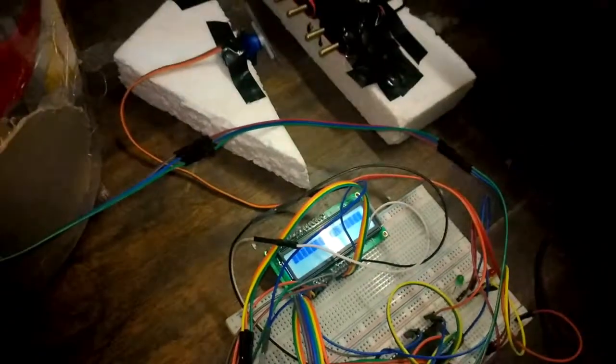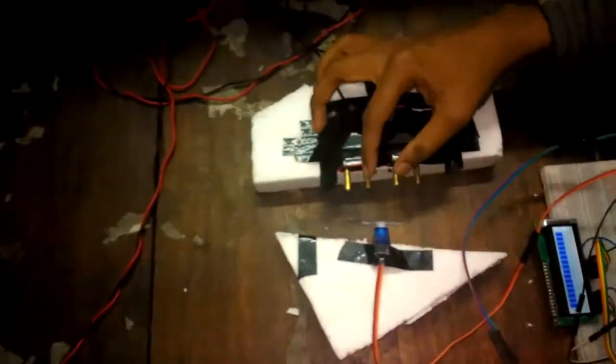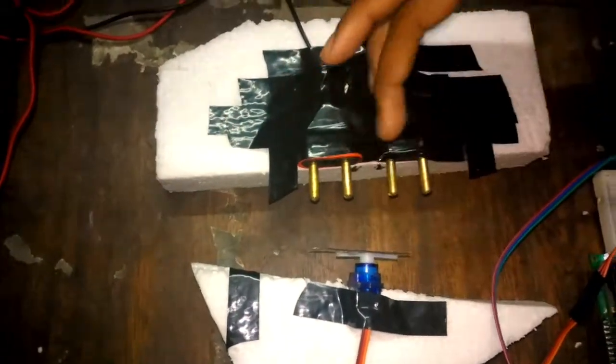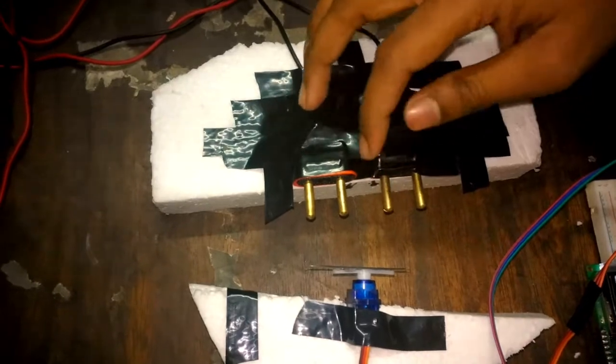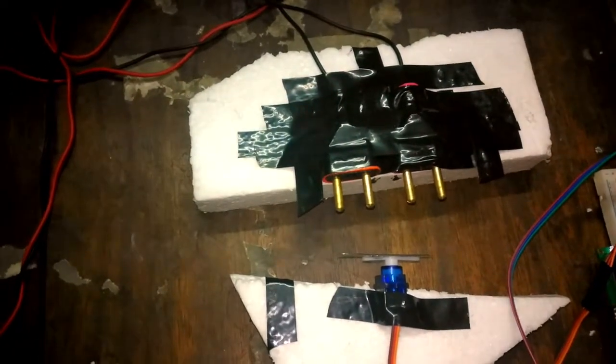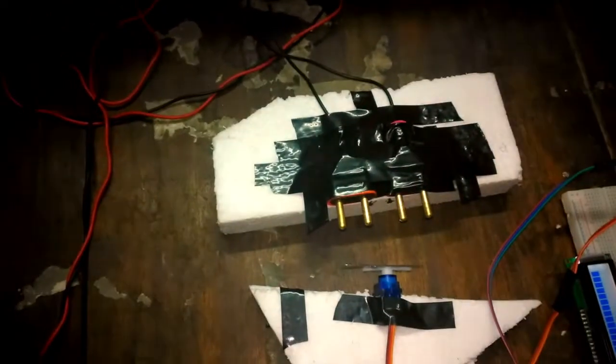We have divided the connection of the bulb and given this connection in 2 ports. Initially it is disconnected. The servo motor will touch these 2 ports and fill the connection, so the bulb will light on. At the sustained temperature, the servo motor will rotate and open the connection, so the bulb will turn off. This is the code portion of our project.